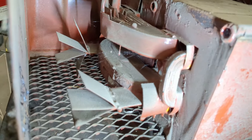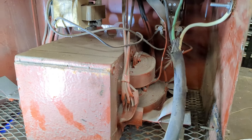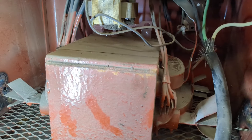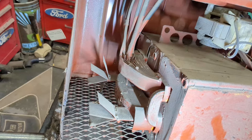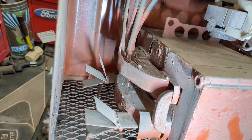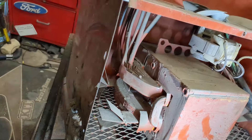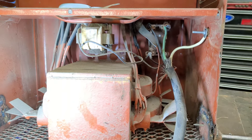The windings all look good - nothing looks overheated or melted. Just a little side note: there's a misconception that these older units had copper windings - they have always been aluminum, and they're aluminum today, all the way back as far as they go. There was a welder that came before this that did have copper windings, but these are all aluminum. Not that that's a bad thing, because they never burn up. I've never seen one of these burn up. I think it's just a wiring job.